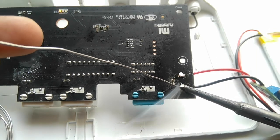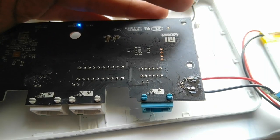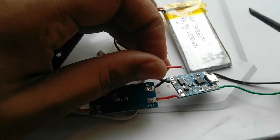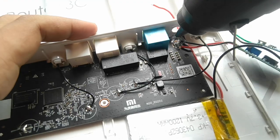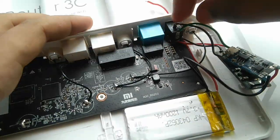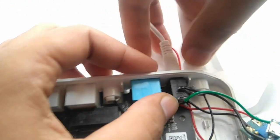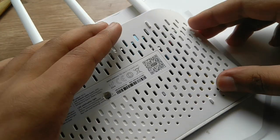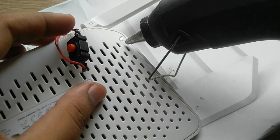You will see that the router starts just after soldering them. We also need to add a switch to turn off the router, so I connected one switch between the output positive and the booster's VIN plus. Now use some hot glue to fix the power jack back in an upside-down position, and don't forget to route the switch wire out. Put everything inside, close your router, then solder the wires to the switch and glue it somewhere.